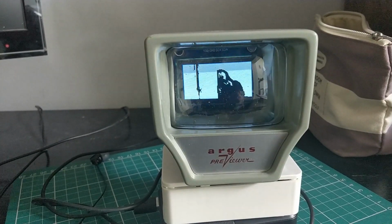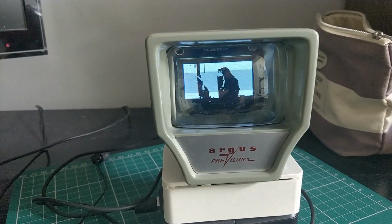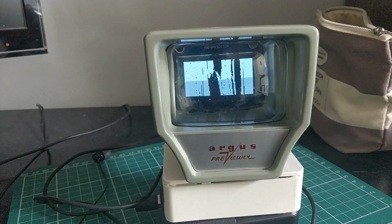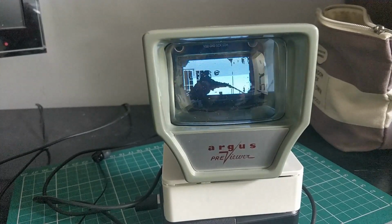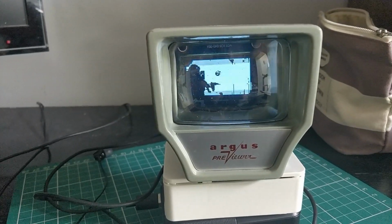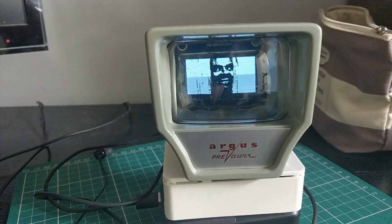So yeah, in terms of how it works, basically program running in Python. Press the button at the back, picks a random video. The video is broken down into frames, and then OpenCV stores each frame, and then we just write that frame to the OLED screen. It's kind of a flicker book effect.